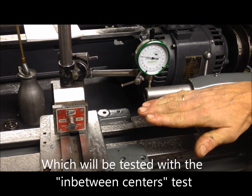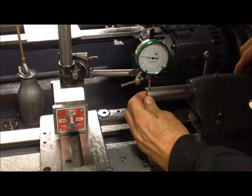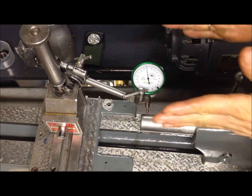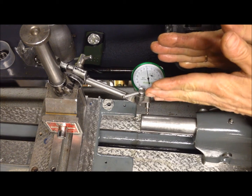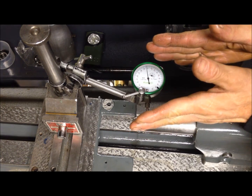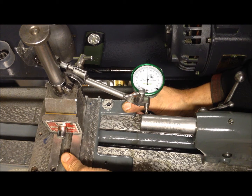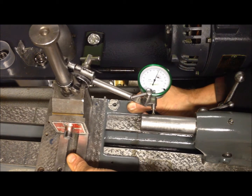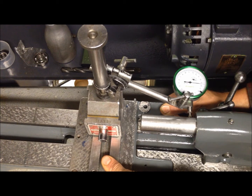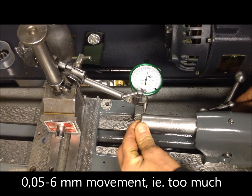If it is low in general to the headstock, you have to shim. All these tests are determining the accuracy of the tailstock. If the needle goes this way, it means that as I go this way, the distance minimizes, which in reality means the tail is pointing in the tool pressure direction. This is correct if it does that. As you can see, it is consistent and moves five to six hundredths in the correct direction, but that is too much.